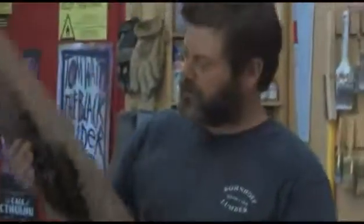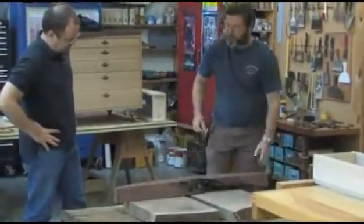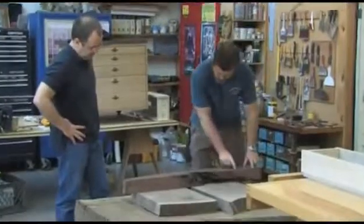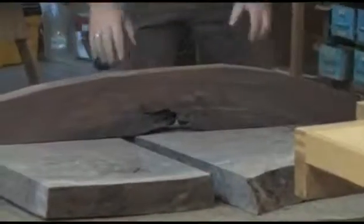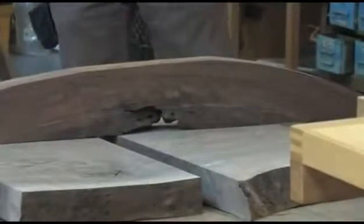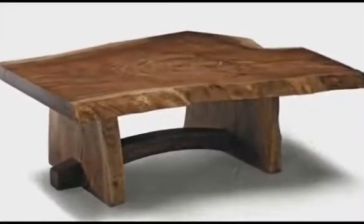And then this is going to be the stretcher. I often design first and then go looking in my wood stock, but I found this neat piece of walnut, and the grain has this cool arc to it. So it's going to get cut out along this white line, and it's going to have just sort of a Japanese touch on this stretcher, where the two ends will sit on the floor, and it'll get bridle joints through the slab legs. That's more of the Krenov approach, where the wood tells you what it wants to be. Exactly.